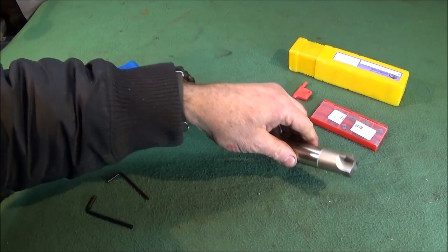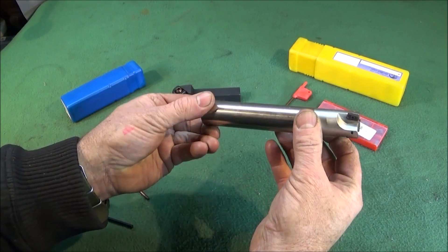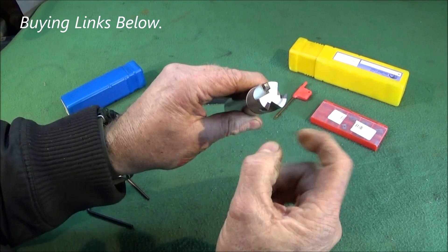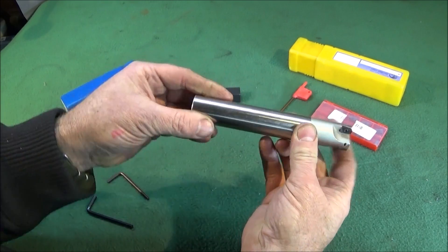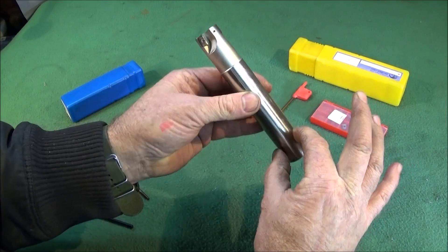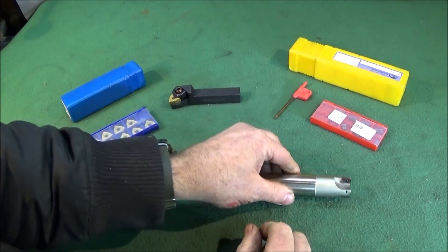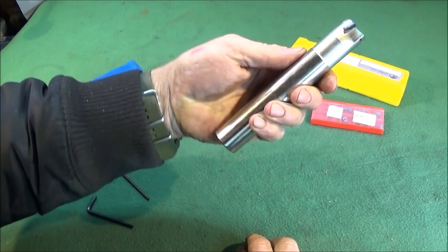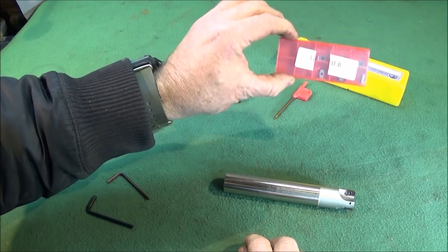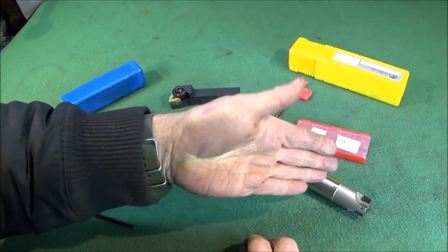I'm going to be doing that using this lovely tool from Banggood. It's a very good price for something heavy-duty like this — a three-flute milling tool, 150 millimeters long and 25 millimeters in diameter. It has three carbide inserts, and you get the tool without the inserts and have to buy the inserts separately, but altogether it's a very good price and a super tool to have.